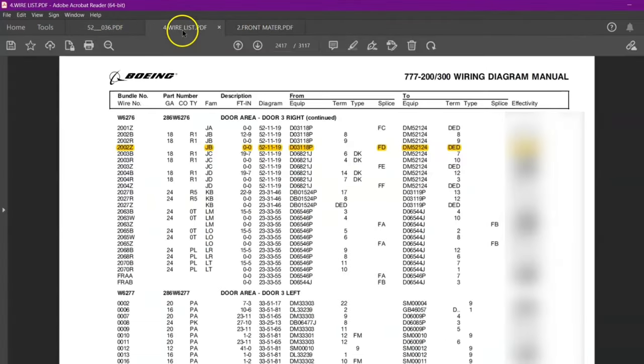Okay, so it will give us each and every detail, how to install, how to insert the cable, you can see the part number. Now ours is 16, which is grounding module with size 14 contact cavity. Okay, so you can come down, it will give us the detailed diagram also. See, this is the grounding module what we saw, and it will give us each and every detail, how to insert it, how to remove it, the removal tool, the inserter tool. This is the contact part number which we already got. With this, we complete our example 3 and also part 2 of our video.